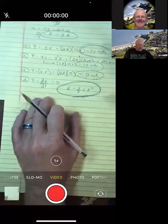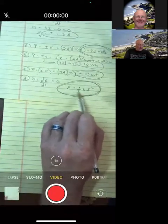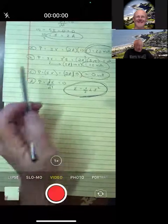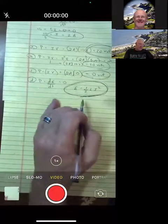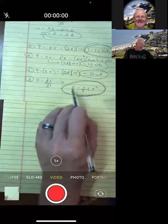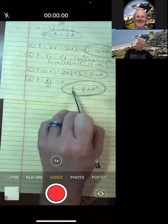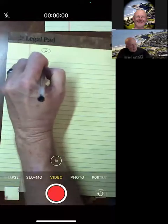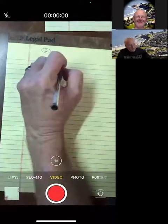In fact, my only maybe complaint about this equation is that it hides the fact that the energy is in the magnetic field. There is nothing in this equation that says magnetic field. However, magnetic fields do come from the current. So that's the real positive about this equation. This equation is saying there's energy stored because there's current. And I'd say, yeah, because there's current, there's a magnetic field. So this kind of goes from the basic current to the second step of there's energy, and it kind of skips over the magnetic field. So very useful equation, and it's perfect for this particular problem because we can put in the 1/2 and we can put in the 10 henries, and we can now put in the current of 2 amps and square it.